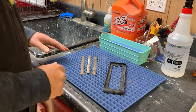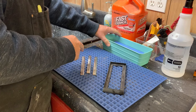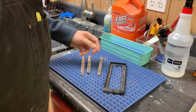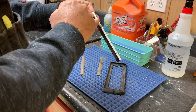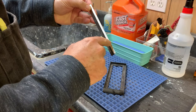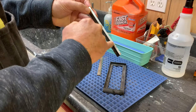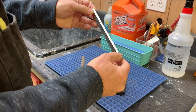I put the stone into a bath of water to let it soak up as much water as it can for a better finish. Now let's talk about cutting the secondary angle. The primary angle is 35 degrees. Now I want to just take the very tip of the knife and hone it to a very fine smoothness at a different angle — the secondary angle. I'm going to make that 40 degrees. That way the secondary angle is more obtuse than the primary, and I'm just going to take off this edge at a higher angle to make a nice fine edge — just like a razor blade.